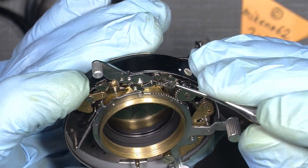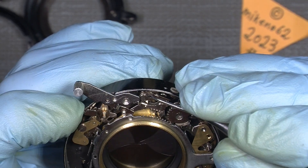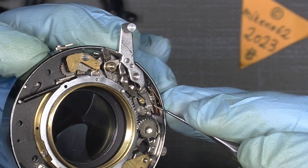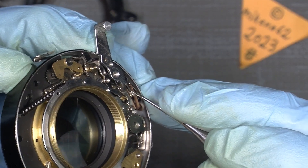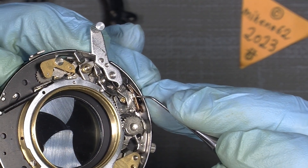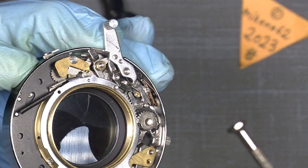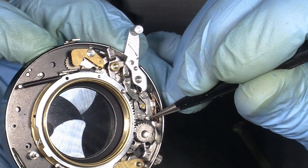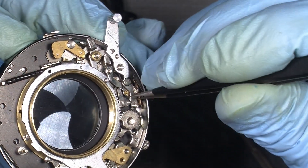Also on the other side here — you really have to make sure there is no tension on the spring. The short end of the spring has to go on this side, and the other end of course has to go around this little pin on the lever, and then it will be correct.